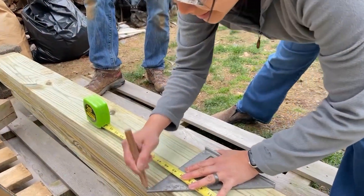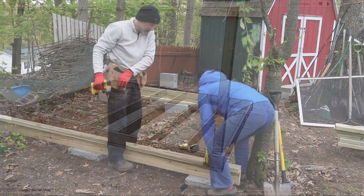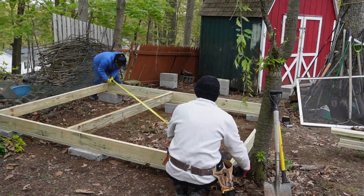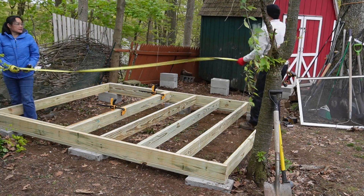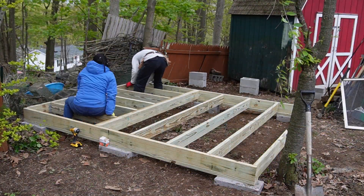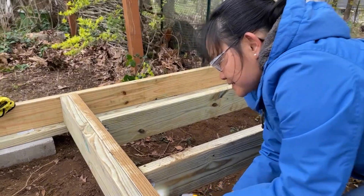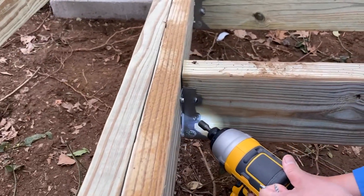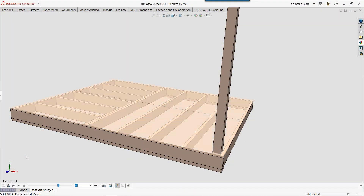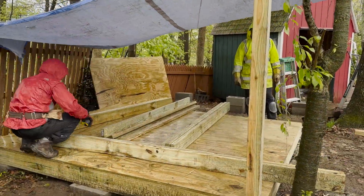One large element of the design was a new deck. We built it in two sections, starting by screwing a pressure-treated 2x4 to the bottom of the 2x6 rim joist. This will act as a sill plate that rests on the footers and supports the floor joists. At the back of the deck, where the storage area will be, we turned the joists 90 degrees and hung them on joist hangers. In our haste to get things done before we lost daylight, and because we started to hear that the tiny forecast of rain was threatening to become worse, we forgot to install the hangers before mounting the joists — that just meant we had the slightly more fiddly job of hanging them in place. Once framing was done, we covered the deck with pressure-treated plywood, giving us a nice flat surface to work on to build the second deck.